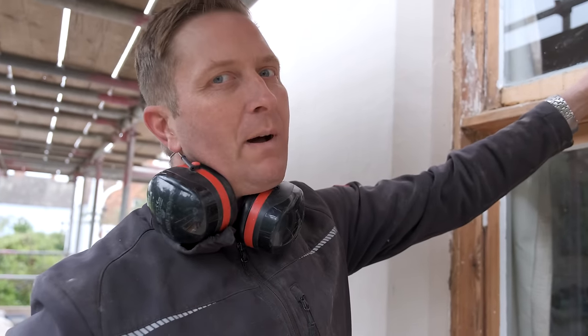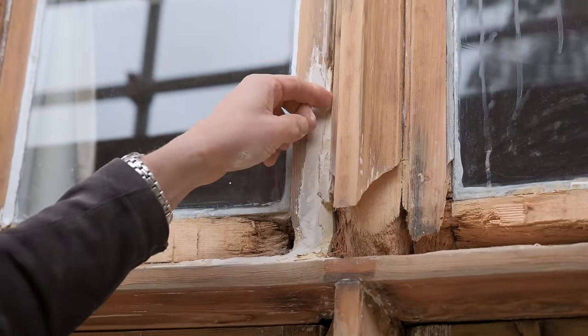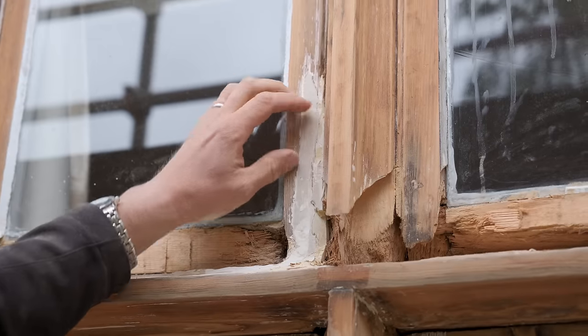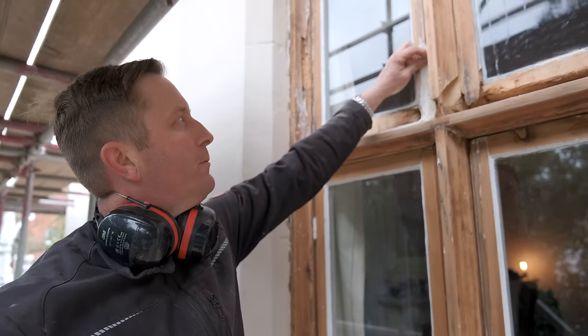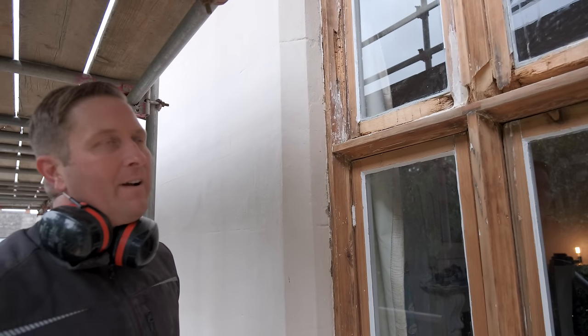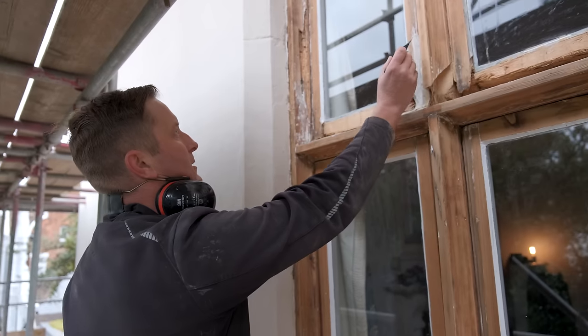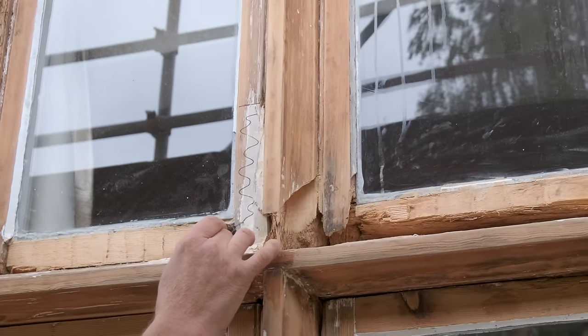This is old two-part filler. There's nothing really wrong with old two-part filler as long as they've dug back to decent timber. However, you can see that behind this the water's got in because it doesn't seal properly in places — it will seal properly between one piece of timber but not between two. And that's where the timber care resin really does do well. But I think I've already got some of this section machined up. The timber care, although it's brilliant, is very expensive, so I'm probably just going to cut that back carefully and get rid of this piece here. In the long run it's quicker — it's a better job.